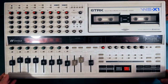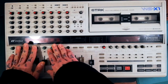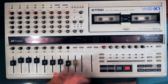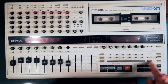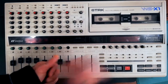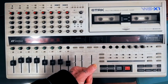When I flip this over, there's a fair bit of weight - maybe 8 to 10 kilograms. I don't really want that pushing onto these knobs, so I'm going to take the knobs and faders off now. They'll all just pull off from the front. All these tactile switches and push-push switches are rear mounted so we can leave them, but the faders and knobs that protrude from the surface can be pulled off from the front. I'll come back once those have been removed.